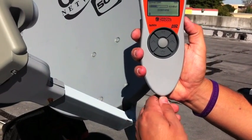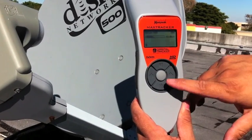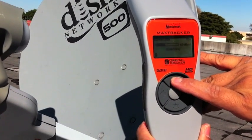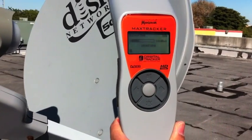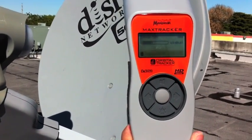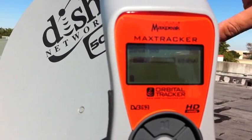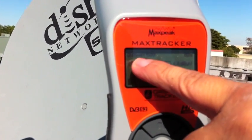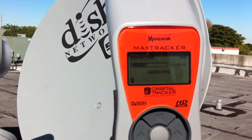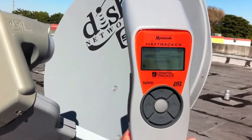I'm going to turn on the proximity alarm — you have the option of turning it on with this button here. Just hold that down for a little second and it'll start beeping. As you get closer to the signal, you'll see that it's in search mode right now. It's a Dish 500 dish, and you can see the file name is Dish 500 — so when you download it to the meter from the hundreds of files you can download, it's self-explanatory: Dish 500 file.